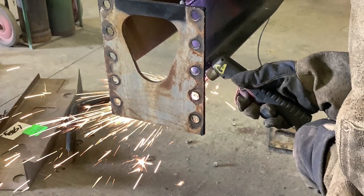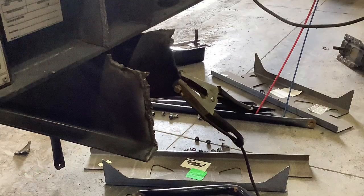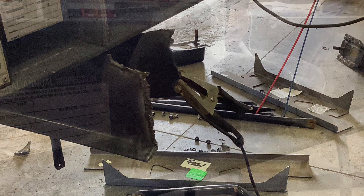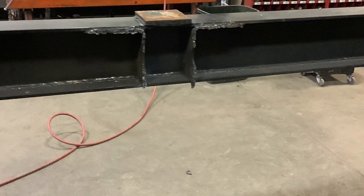In the video and in this image, we're using a plasma cutter. Continue to use your plasma cutter or torch to remove all the damaged sections of the structure and any attaching parts that may need to be removed.